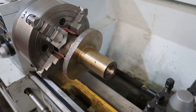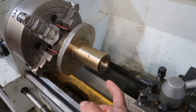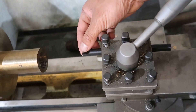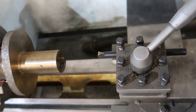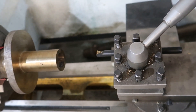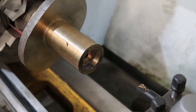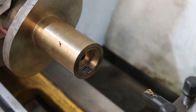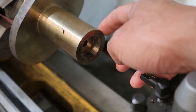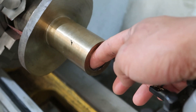I've already gone ahead and set up a bore in here - I just machined that out more than 10mm deep. I've got one of these right hand or left hand internal borers, which means that you can actually pull the thread out. Instead of going in, you can go out because you set the lathe up in reverse. I've done a scratch pass in there, checked it, and it looks like it's the right dimensions. So now I'm going to cut the thread deeper than it needs to be and then machine the bore out a bit more.